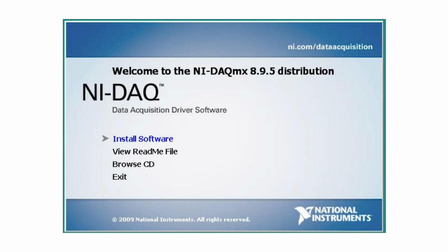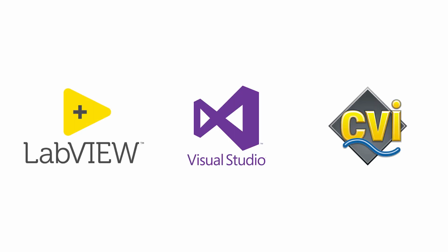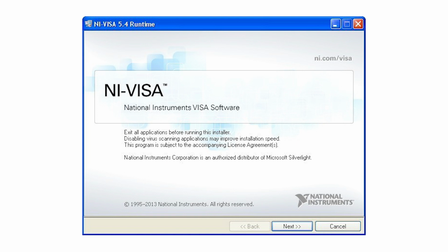The PXI-8186 operates using multiple software. One of them is NI-DAQ, which hosts a library of functions which can be utilized from your application development environment of choice, ADEs, such as LabVIEW, Measurement Studio, and LabWindows/CVI. Another software which the device operates on is NI-VISA, which is used in creating applications and instrument drivers.